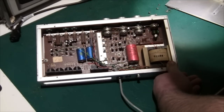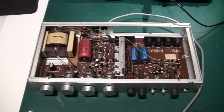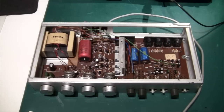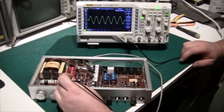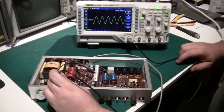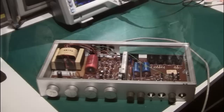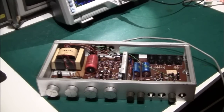So yeah, I like it. I'm not sure whether it works or not, but let's try and power it on. Everything powers up, so let's probe around with my oscilloscope. There's a massive sine wave on top of the rectifier diode — so that can't be good. I'm going to leave the repair of this machine for another day, but it's definitely repairable; it's just basic transistor electronics.